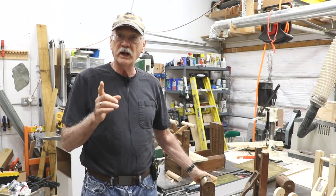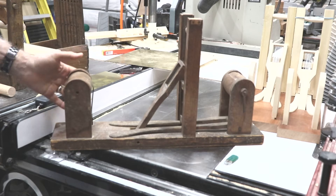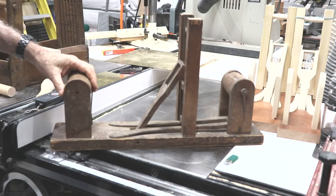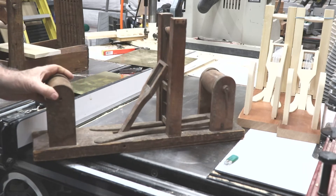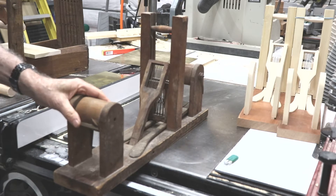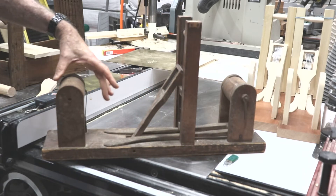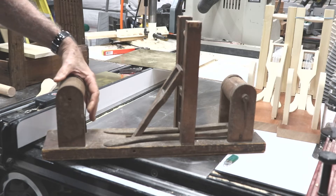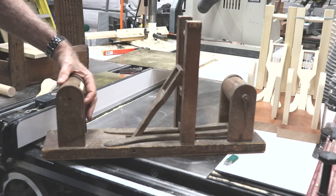Let me show you what I have to duplicate. Mara is duplicating this loom — she's making two copies of it. We think it may have been used for lamp wicks. It's a Shaker design, and this drum here has a ratchet and a pawl to maintain tension on the warp like any other loom. You have to maintain tension. The other side has a friction lock.